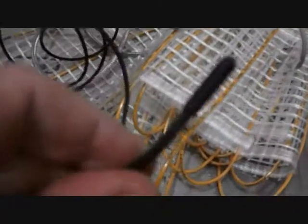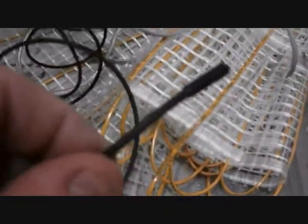Okay, 6:11 p.m. I have made up a wiring harness here of the heating elements and the two thermostats, or sensors. They have two. It comes with one, but you can buy an additional one. It's just a resistor on the end, a thermistor, I guess. That's a temperature sensitive resistor. The colder it is, the more resistive it is, so there's less voltage sent back to the computer. Or maybe it's the other way, whatever.